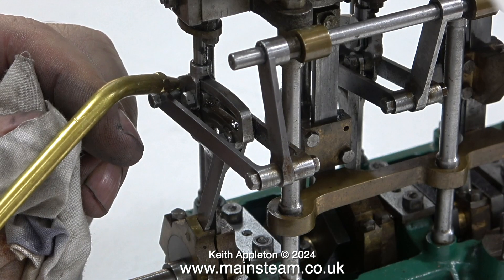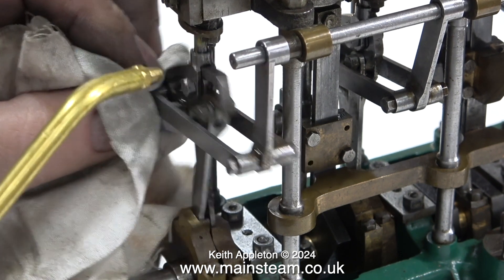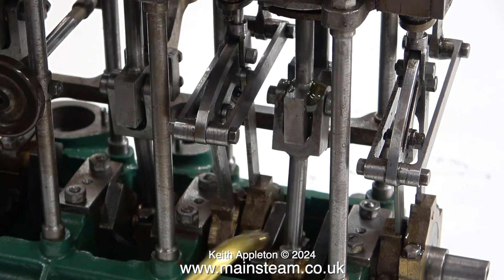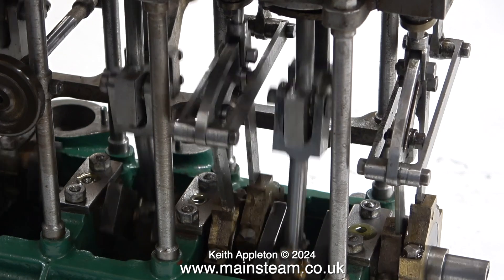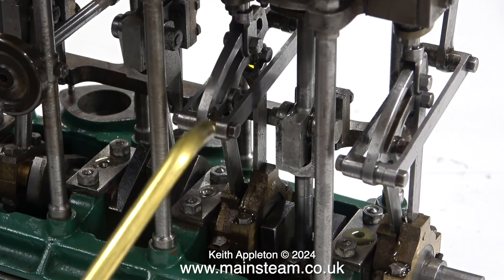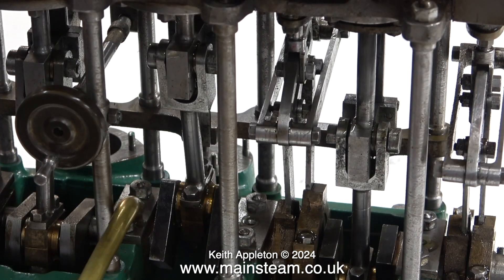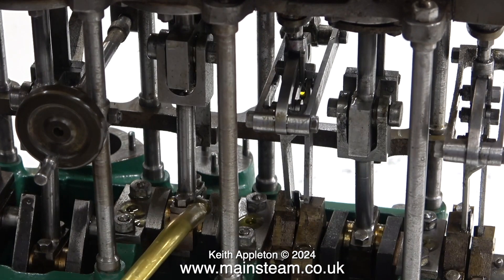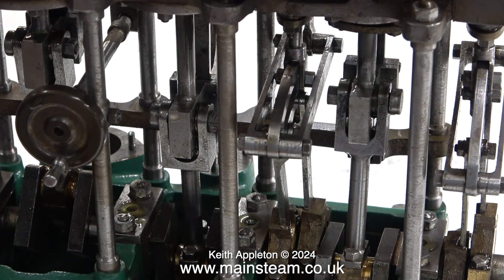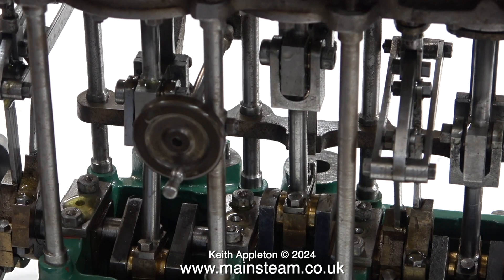I think what I'll do first is oil up the engine to see whether or not it runs. It's quite interesting to think the original builder probably did exactly the same thing many years ago. I'm being quite thorough with the oil and trying not to miss anything — I did miss a couple of the eccentrics but went back later to do them. With any type of engine that has moving parts, lubrication is very important, and more so with a steam engine because the working parts are exposed and it's a total-loss oil system. The motion work on this engine is very well made, and on a triple expansion engine a lot of parts move — some inside the engine where you can't see them — so it's very important to make sure the cylinders are well lubricated.